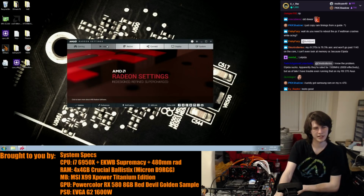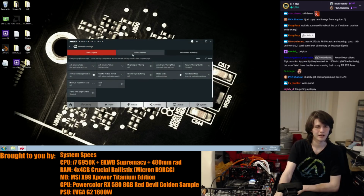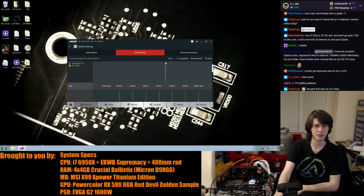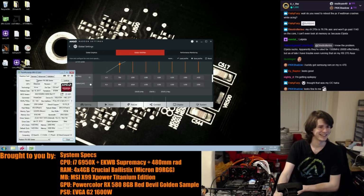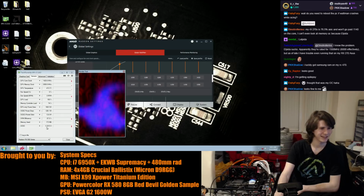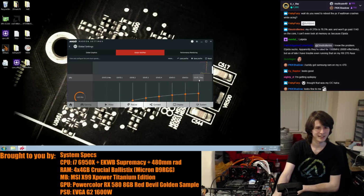No, but I had my 290X with Elpida memory would do like 1550 memory clock for daily, actually. I ran that daily. And for benchmarking, I could run like 1600 plus even. Oh yeah, 1350 core voltage. Burn the house down. Let's see. Does it actually? Oh yeah, it does 1330. It does 1350. So let's just set that as the minimum state.